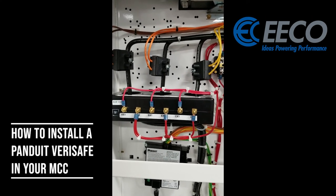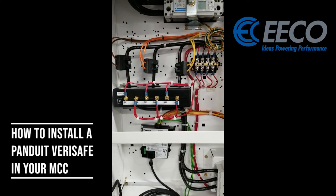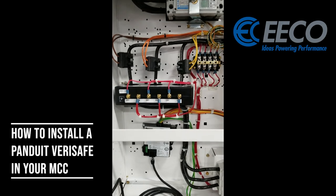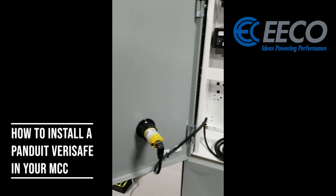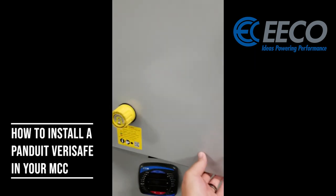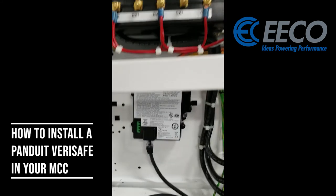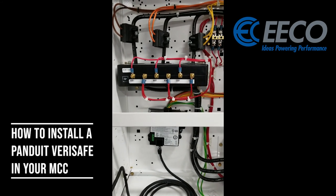I have it installed on the line side of the breaker — incoming power — so I can make sure there is no 480 or 240 volt present inside this unit whatsoever. I have to kill the main breaker or disconnect upstream to make sure this works. That's it for the VeriSafe. You've got your module here, which does the visualization with the battery inside. We've got the cable that runs to it, and then the base module — that's the brains of the unit — and just the whip. You can order different lengths of whips; they've got ones all the way up to 10 meters.